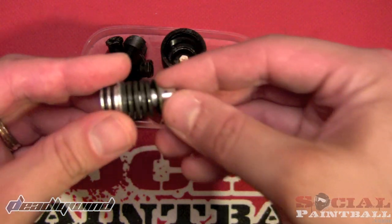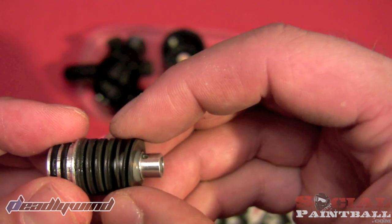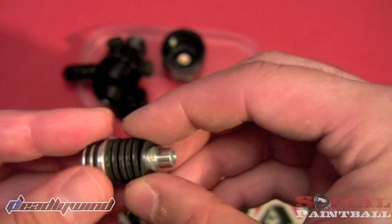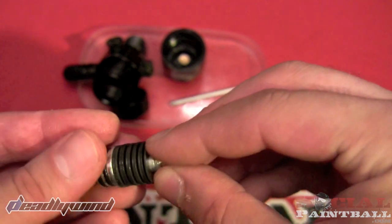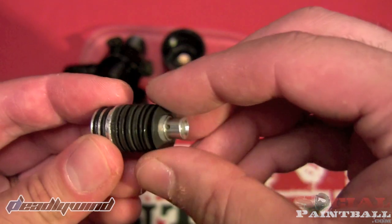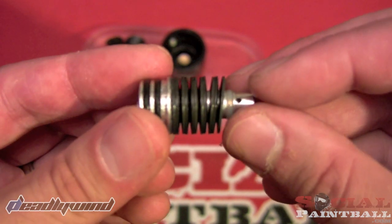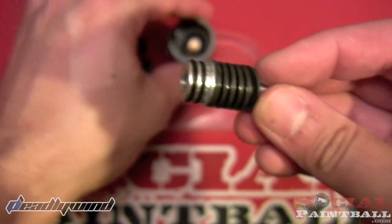Once you've got the bonnet off, you can take this apart and see the inside. Here are the shims — let's count: one, two, three, four, five, six, seven, eight, nine, ten, eleven. That's just what I expected from what I heard. Having that many shims gets you up to that pressure. I count 11 shims, with just the top one going the opposite direction. There's also a little o-ring here. I'm not going to remove a shim, but I wanted you to see how many shims are used in this regulator. There's the spring — don't lose that.